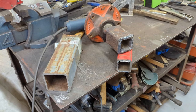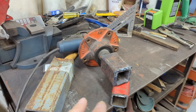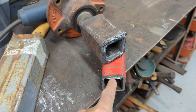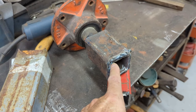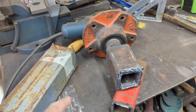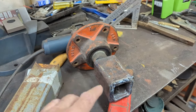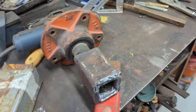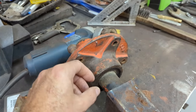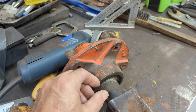I've been working on the pivot point a bit here. I've got the hub out — the hub is not all the way in the way I want it. What I have is a length of two and a half inch and I had a length of two inch hitch stock. The hitch stock fits perfectly inside the two and a half stock that I had. And the two and a half will fit inside the three inch. So I'm building up a solid piece. I welded both ends and ground out the seam with the die grinder for the two inch, which allows the shaft to go in.